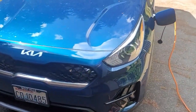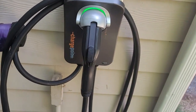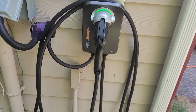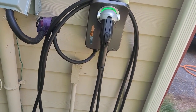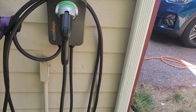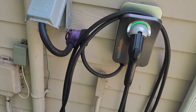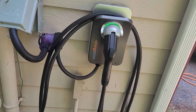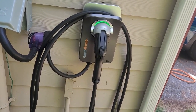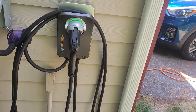When I charge the Kia I have a Level 2 charger here — a ChargePoint Level 2 charger that runs on 240 volts. Here in the US our houses are wired for 120 volts, and if you want 240 you have to have a dual-phase connection. I've got that here, and of course in the house we have dual phase for things like the electric water heater, electric range, and electric clothes dryer — three things I can think of that use 240.